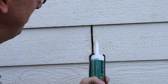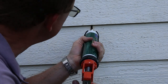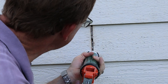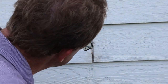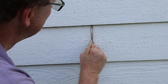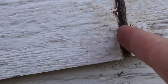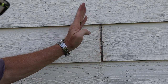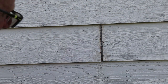I just drilled a hole in the tip of the caulking tube rather than cutting it, because I need as long a nozzle as I can to get down in there and set the caulking against the house — I want it to set on the tar paper. I shove this up in there, it goes over the top of it, and a little shim holds it up all the way. Then I push it in there real tight and the caulking will set up and seal it off. I'll come back and peel bond, prime these edges, paint them, and then put caulk in there again to seal over all of it and keep it waterproof.